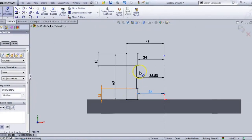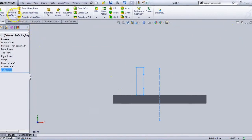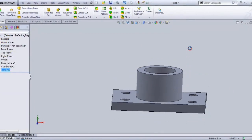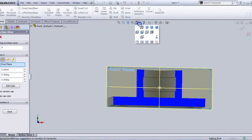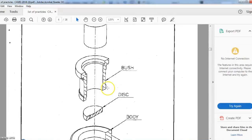We are going to draw like this. All the sketch is now fully defined — you cannot add more dimensions. After you draw the sketch, exit the sketch and use the Revolve Boss command. After revolving, you are able to see the object and view the sectional view, which is similar to our target object.